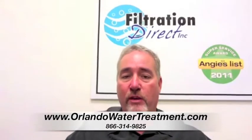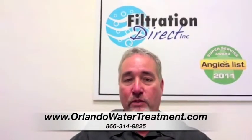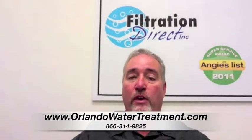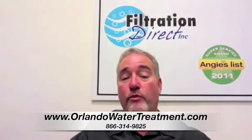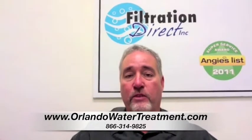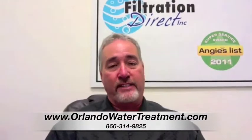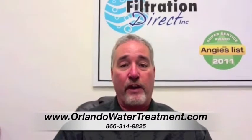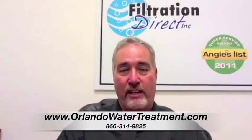When the system does go into backwash, the salt brine solution — and a lot of people get confused about this — is totally eliminated from the water softener. On all of the good water softeners, you can actually adjust the drain side or the rinse side so that you rinse out all the salt, and you start with just what the standard water supply has in it. Here in Florida, the standard water supply generally has about five parts per million of salt anyway, because we are nothing but a giant sandbar.